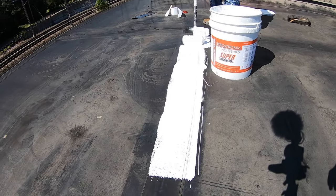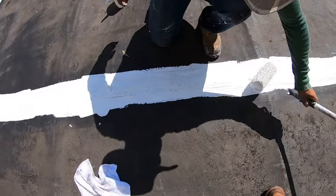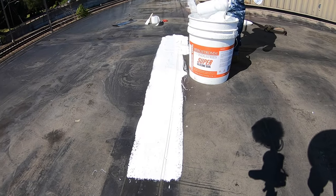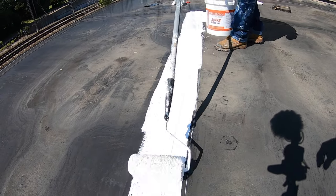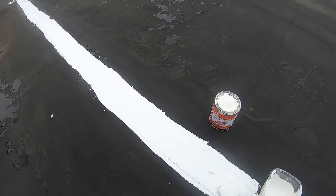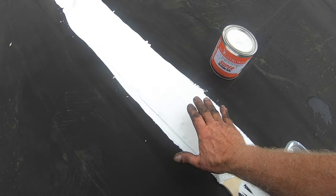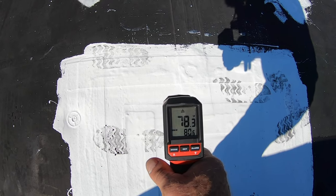The next way to extend the life of this roof is by just painting the seams — that's it, with the roller. Wherever we find a seam that's not good, we put a fleece, like in this case. And that's it — now you're extending the life of this roof. There's not much work to it; anybody can do this. As long as the tape is in fairly good condition, this is like 90% okay with a few bubbles here and there. This does a twofold purpose: it seals around the seam of the old cover tape, and it protects the existing uncured cover tape from UV and from heat — 78 degrees here, which is double the temperature on an EPDM.